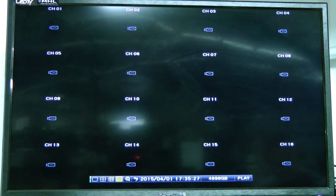What we're going to be doing is setting up a DVR on the local network so that we can use our PCs to review footage, download incidents that need to be recorded, or just monitor the system. The first thing that you can do before you do any setup with the DVR is, at your local computer, go ahead and get your VMS software installed, set up, and watch the tutorial videos on how to use that. Once you're done with all that, come on over to your DVR.